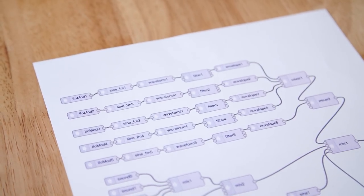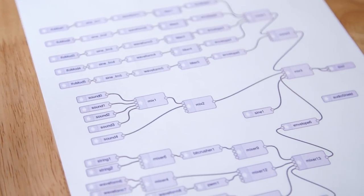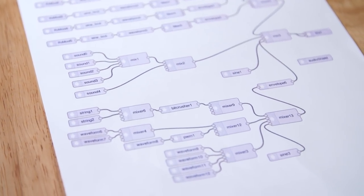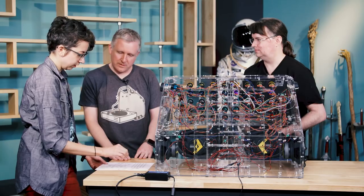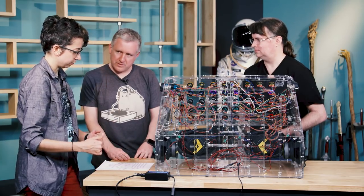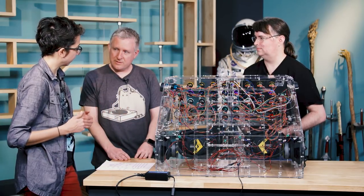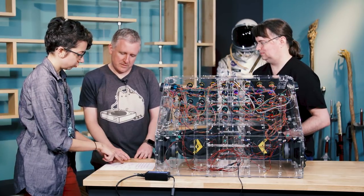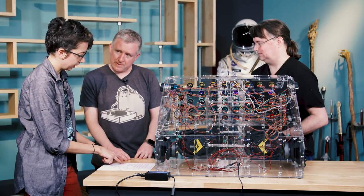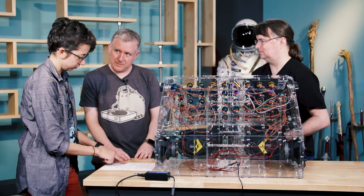Yes, this works with the audio adapter board that's connected on the Teensy, and it uses the audio system design tool, which allows you to bring in these different objects and then connect them together however you would like the sound to flow. It will export the majority of the code that you need that works out the signal processing for it. And for each one of these objects, there are really handy functions that you can use to trigger the different parameters of each of these.